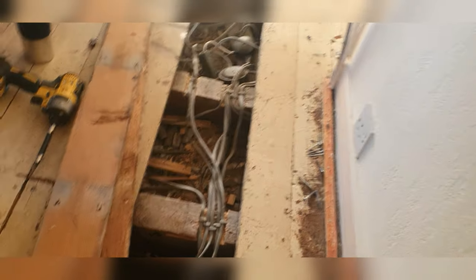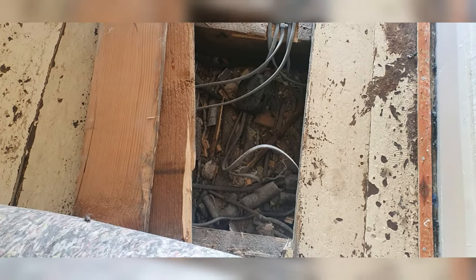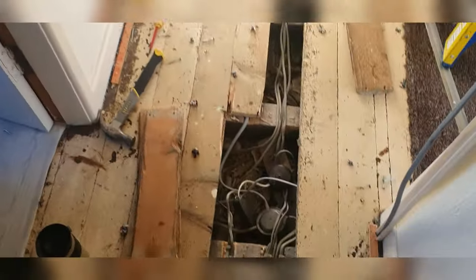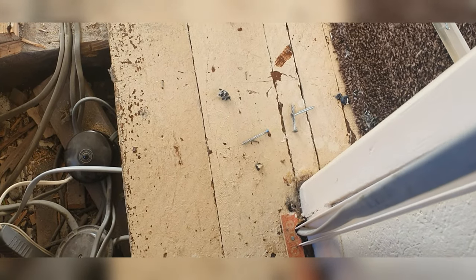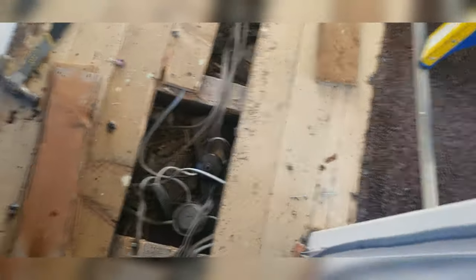Look what Michael's been doing! Mike's lifted up the floorboards - look at that, beautiful. So I can get to the downlight without breaking my leg. There's the transformer we couldn't pull because it's on that JB. All we're going to do is take this off the JB, put some 1mm in, and chuck it down.